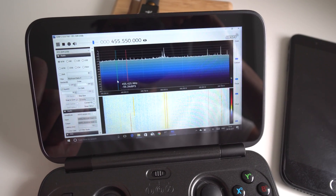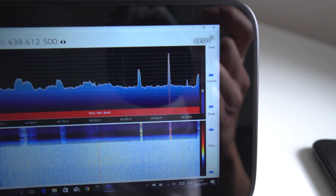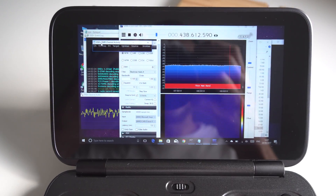It was a little bit ambitious trying to do this on a tiny antenna in the room and pick up DMR signals from the airport. What I should do is go into the workshop and connect to the big antenna. But I have got this little DMR radio here, so let's see if I can decode that. You can see when I key up there's the signal, but we need to feed the output into a digital decoder.